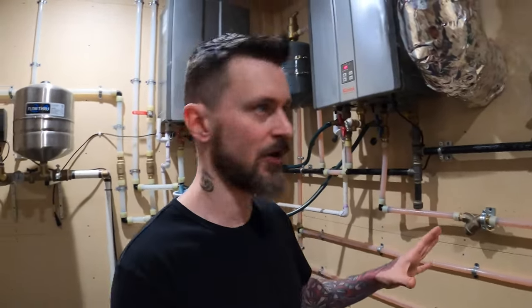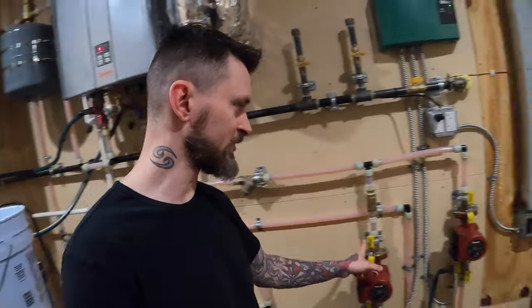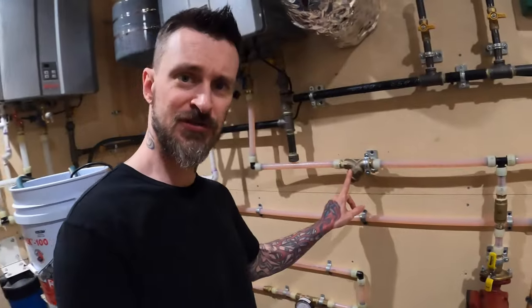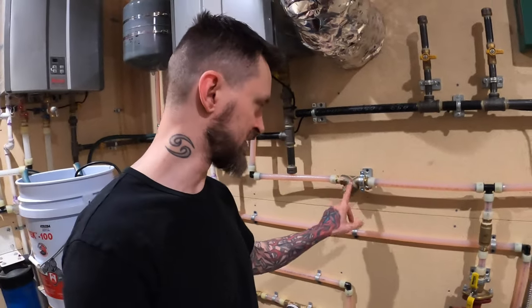This summer we're going to do some maintenance on this without getting any air in it again — we can shut it down right here and at the pumps. Two more maintenances I need to do: one, remove the external check valve on the basement side since we already have one in the pump, which should let it run more smoothly. Two, there's a screen right here that we can also unscrew, but that screen has about two millimeter holes and is only catching large debris. The micro filter up in the tankless being nearly completely clogged was basically stopping all flow. So it was kind of a blessing our pumps went out — we upgraded anyway and should be more efficient and spend less on propane going forward.